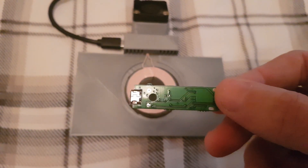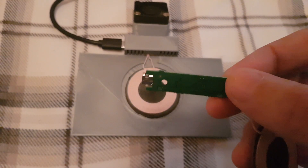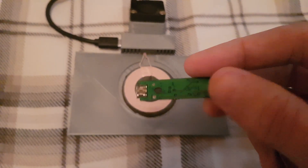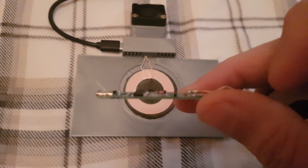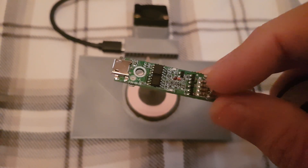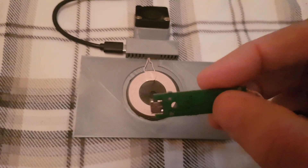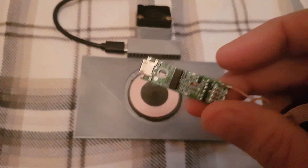What I did was I bought some heat sinks — about a centimetre by a centimetre, black anodized. I couldn't stick them on the component side because of these raised chips, and there's also the potential to short out the capacitors there. So I had to stick them onto this side of the board. It still works and still gets the heat out of the board, but these do get really hot.